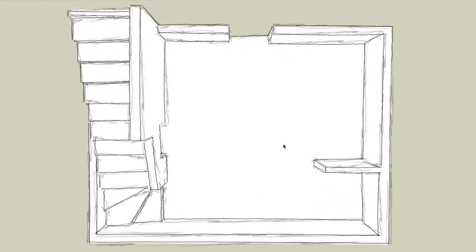For lighting, we're going to put a light here at the bottom of the stairs — you've already seen where we're putting the box there. And then on the same circuit, there'll be a light in this area. This light and the light at the bottom of the stairs will operate off these two switches. And then we want to put three pendant lights over the countertop here, and also a small pot light in front of the washer and dryer. Those will all operate off a dimmer switch that will be located in this little half wall here.